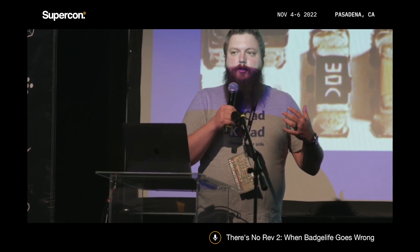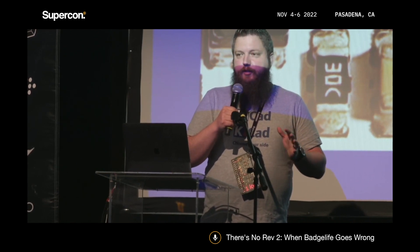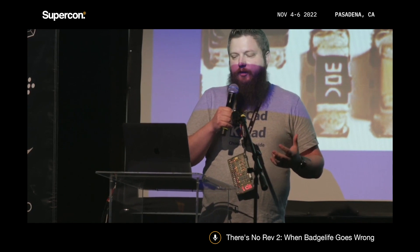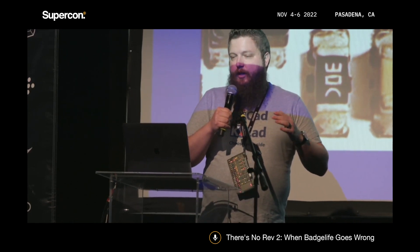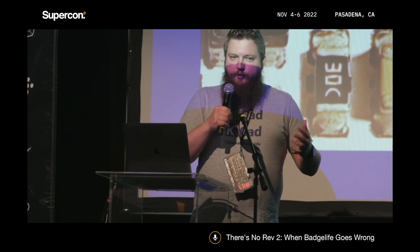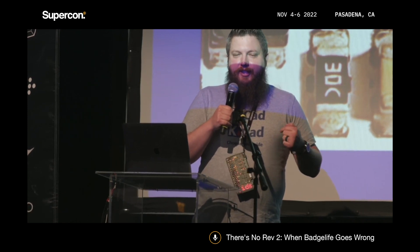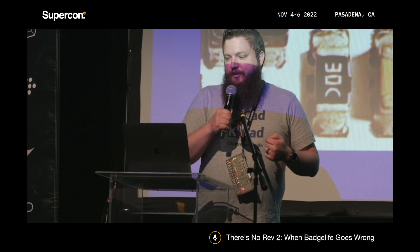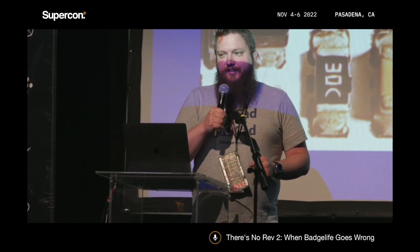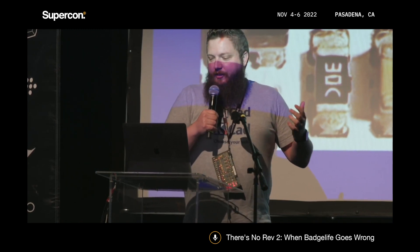Initially we were going to use the audio cable as a lanyard, the prototype worked great, but we decided it wasn't strong enough to hold the badge. Then we couldn't get the amplifier we planned to use, so last minute we re-spun the board, ran a prototype, and it worked fine — except I didn't test plugging the lanyard into itself. That's a big lesson: regression testing. Make sure everything that worked on the first version still works on the second.